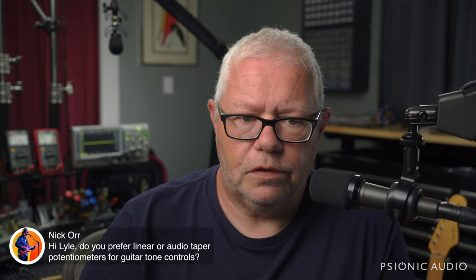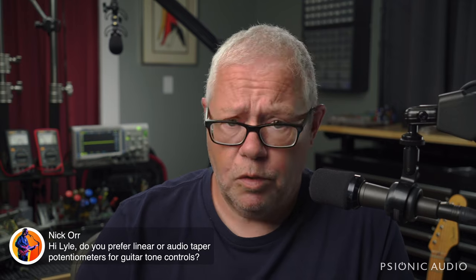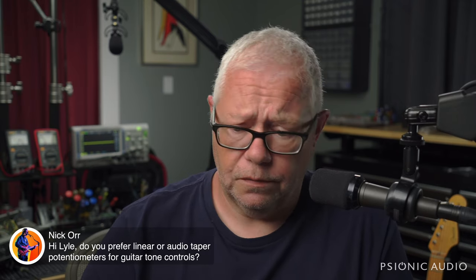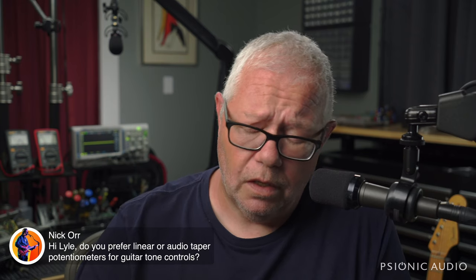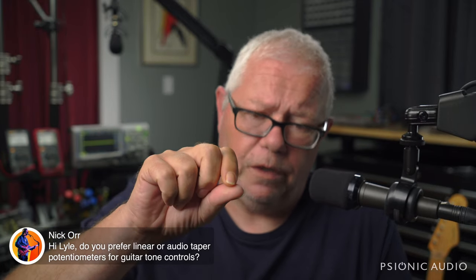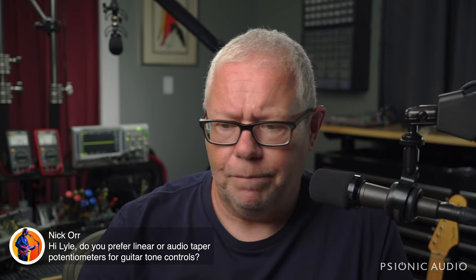Hey, Lyle, do you prefer linear audio taper pots, potentiometers, for guitar tone controls? Assuming you mean specifically for the tone control, always, always audio. Because if you have linear, then you're going to have almost no change from 2 to 10, and all the change is going to be from 2 to 0. So all the change in a very small window and then nothing. Whereas with audio, you're going to have all the change in a fairly wider spot and then subtle changes up to the top.